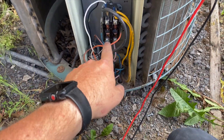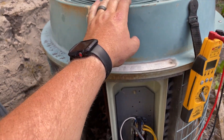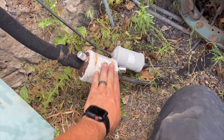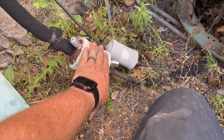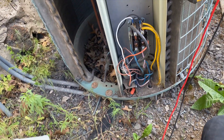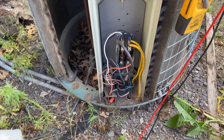The contactor just pulled in - I've already verified there's no voltage. Going to ohm out this compressor. This unit needs to be changed - just look at it. The compressor has already been changed before; you can tell because somebody installed a suction line dryer and never removed it. When you install those you're supposed to take them out after about three weeks. This thing is from 1983.